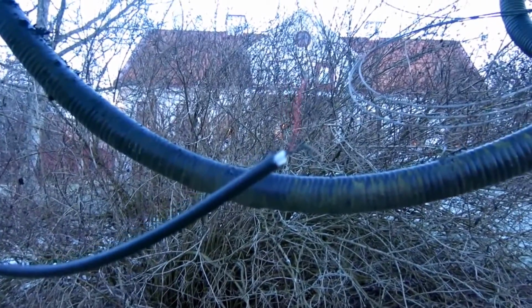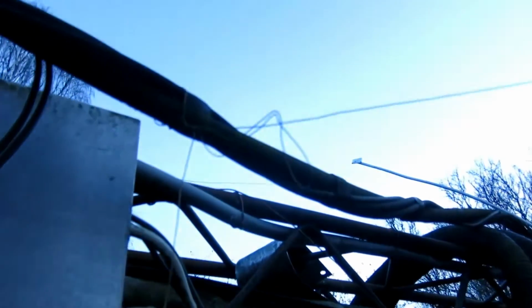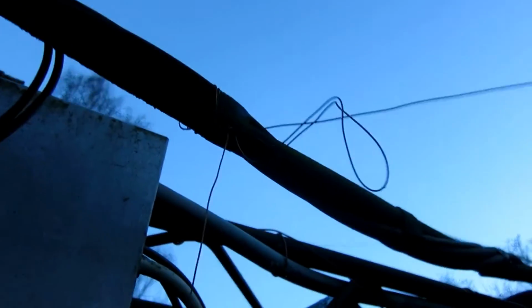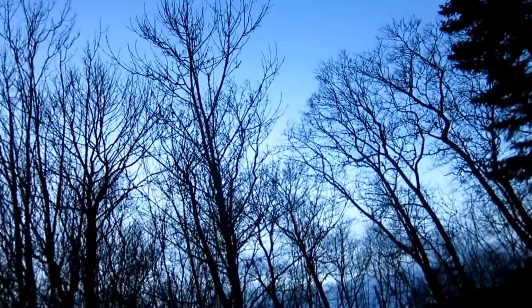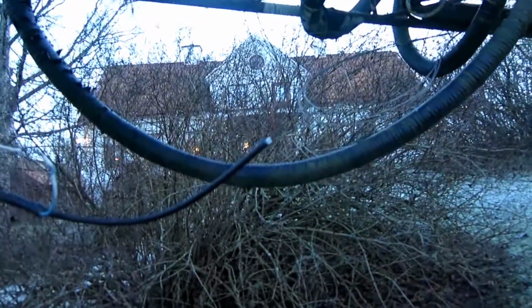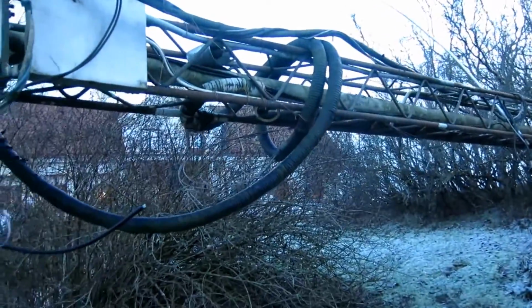This is the antenna. You can see the thin wire here, just wound around some isolated cables, and then it goes up to the tree that you see here. So it is just about 6 meters of wire, 20 meters away from the building. And what you see here is the remains of my 2-meter system. It's just a tower in the horizontal position. But I have good coaxial cables out to this place.